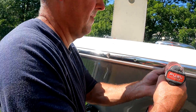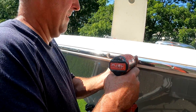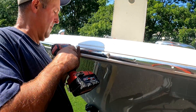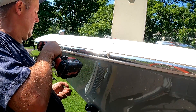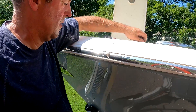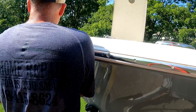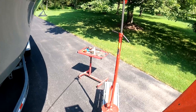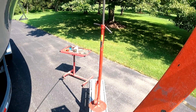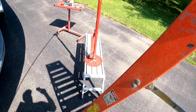Here I'm removing all the screws in the rub rail from the seam all the way up to the bow and skipping over to the nearest ones by the hole. Once you drill that hole you really weaken that metal, so you're going to need a way to support that rail when it's loose. Having a helper would be ideal. I'm going to end up using a large jack stand to hold it — ideally I should have taken the entire rub rail off, but since I didn't have any helpers I Rube Goldberg'd a support system with a jack stand and a step platform.